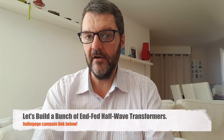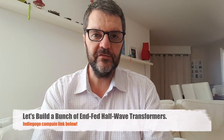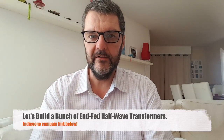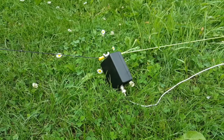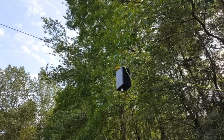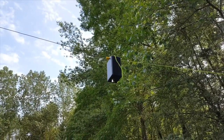The best antenna I have found to fulfill this mission is the end-fed antenna, meaning that you just connect your radio to the end of the wire. But you can't connect it directly to the wire, so you have to use what's called an impedance transformer. And here it is — you just connect a half-wave wire to this box on one hand and connect your radio on the other, and you're good to go. Throw the wire in a tree and you're operating.